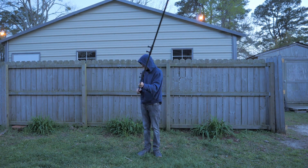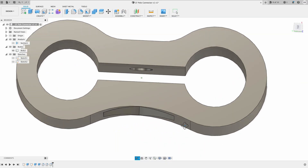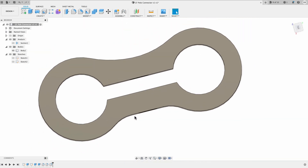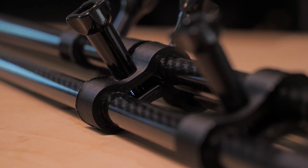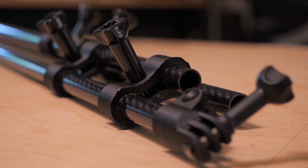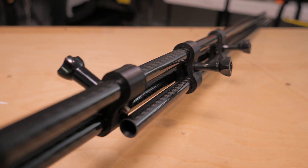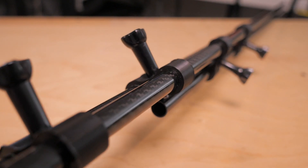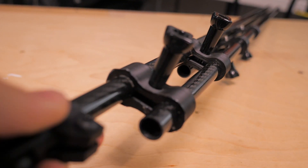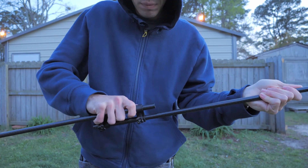These poles are about 14 millimeters in outside diameter. What I did is I made some 3D printable bracket designs that basically let the poles slide together. I used GoPro-style hardware — M5 or five millimeter thumb screws and nuts — to attach them, and that clamps the brackets together and holds them tight so you can keep the poles from sliding and lock them in place.